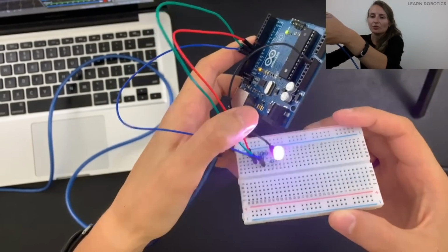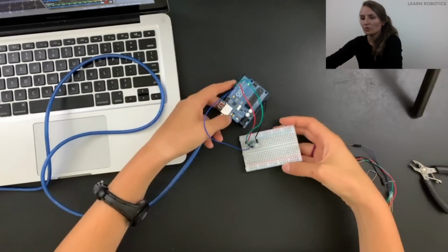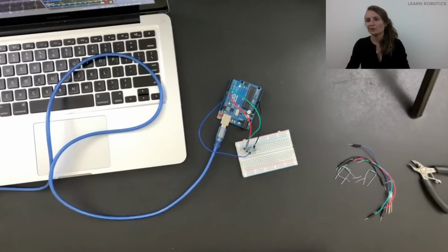It may look a little bit blue, and that's probably just because you're catching some reflections. So there we go. And that's how you turn the LED on and off. You can use the digital write command. You're just going to have to do a digital write pin, like red pin, and set that to low. But since we have this set RGB method already made, we can set it to 0 to make it off. We can set it to 255 to turn it on, and then everything in between, and a mixture of that is going to be a color.